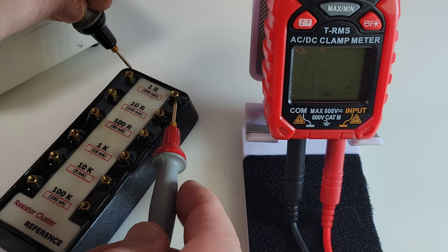Two current settings on the clamp: 60 amps AC-DC and 600 amps AC-DC. Make sure when working on the lower range you have it set to 60 for much better resolution. Hooked up to an AC splitter on a ceramic heater, pulling in just over 6 amps. Cranked it up to the highest level — 15 amps. When we get over the threshold of 3 amps it enters that amber alert mode. Really nice safety feature. We also have the max/min feature — hit max to get the maximum reading, hit min to see the lowest recorded current. Max/min is super handy on any meter, especially a clamp.